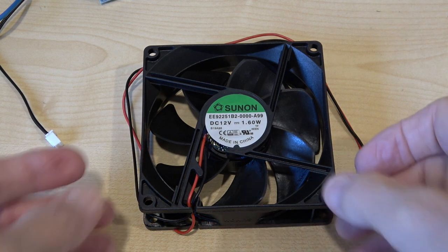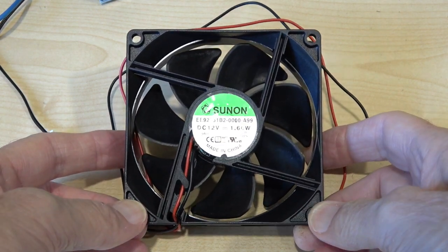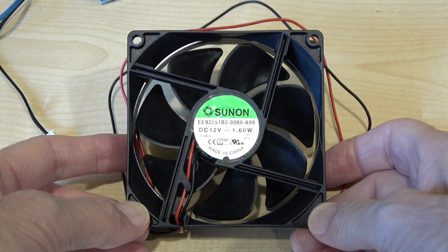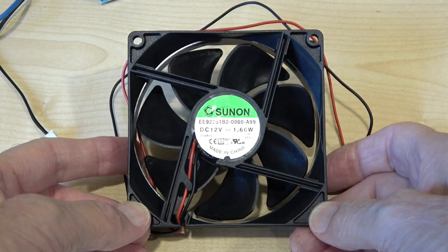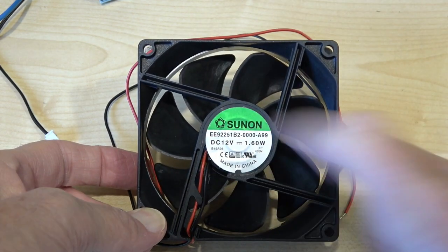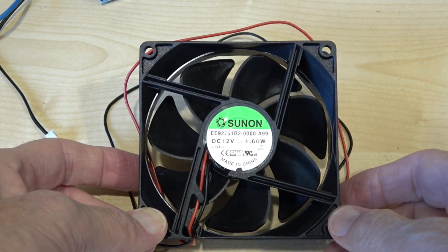It's simply AC in here and 12 volts out here. It's a switch mode power supply with universal AC input - anywhere in the world you can use this and it gives up to 420 milliamps of current at 12 volts. I've used lots of these for all sorts of things and they're really good. Now for our test purposes I'm just using a simple 12 volt fan. It's a relatively large one and not one that I would actually recommend for cooling amplifiers, but it's big and it's going to be easy for you to see rather than a tiny miniature fan.